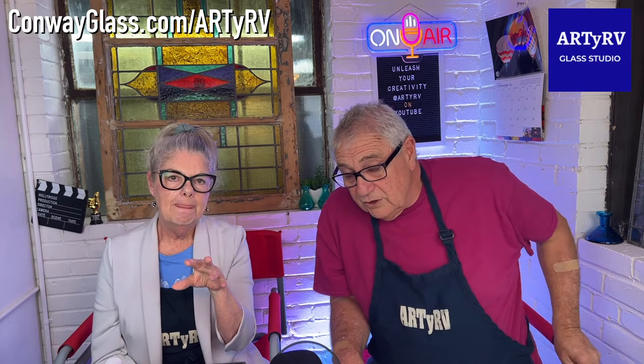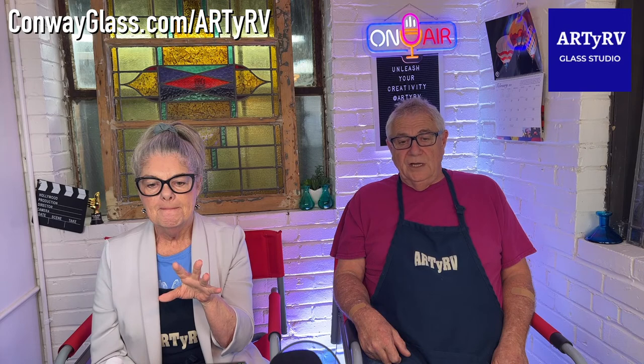Oh, the old windows are going to have lead paint on them. So make sure that it's wet and be safe when you're working with old windows. And keep the little one away from it. That's for sure. Lead paint is really terrible. That will give you lead poisoning. It's dust, you know, when you start scraping, it's dusty. So be careful.